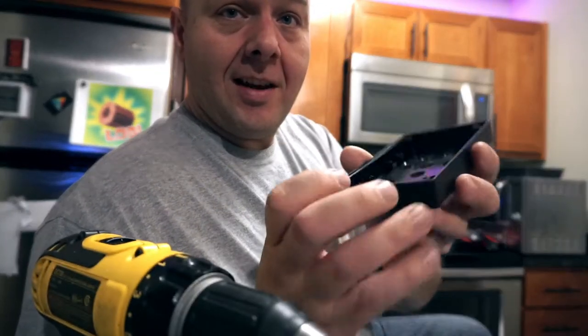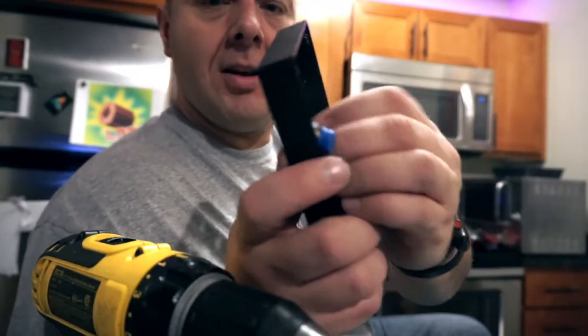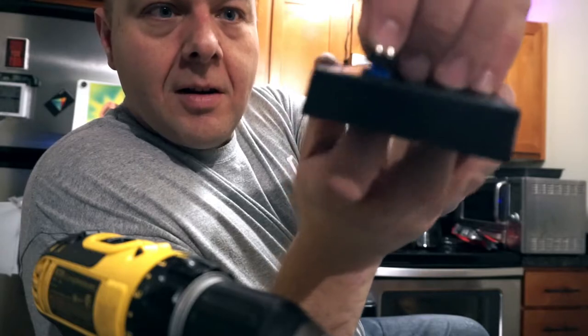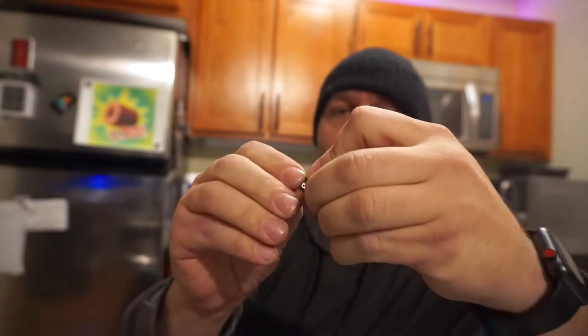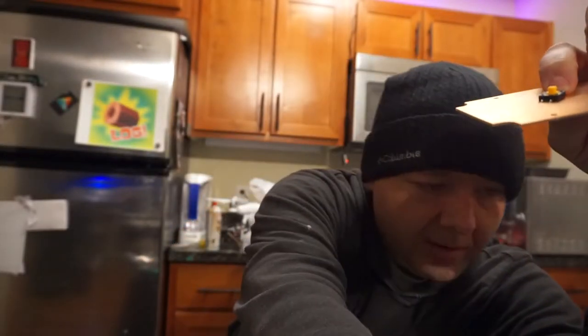This lid was actually designed to have a PCB or circuit board embedded down in here, and these switches are designed to be mounted to that. The problem is I can't just mount these directly to the lid because the base of the switch has to be attached to something so you can push the button - you can see how there's a gap between the button cap and the switch itself. I tried to figure out how to mount those switches and went back to Fry's to get a circuit board to stick inside the box. It has screw holes to mount to the box and I can align the switches under the cover flat on this board.